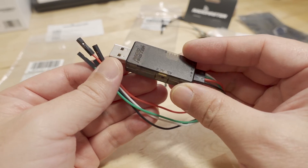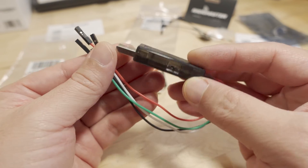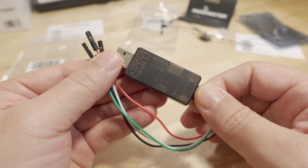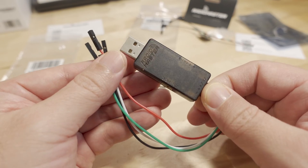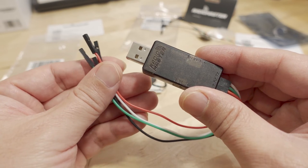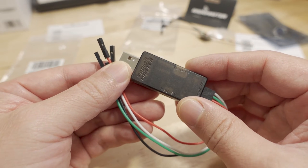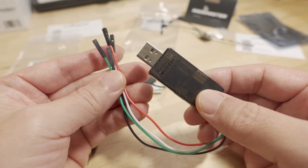The other product is this USB UART tool. Basically, this is another way of flashing your ExpressLRS receivers. In the configurator interface, it'll say UART. Most people use Wi-Fi or Betaflight pass-through as typical ways of flashing receivers, but this is sort of an emergency option — for when you're not able to flash via Wi-Fi, can't connect to it, or Betaflight pass-through isn't working. A nice little tool to have just in case.